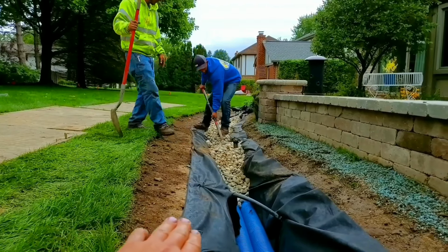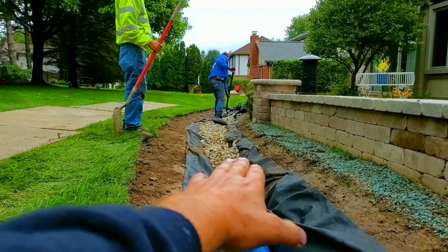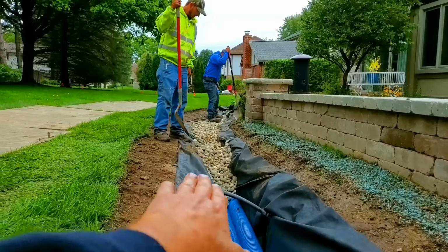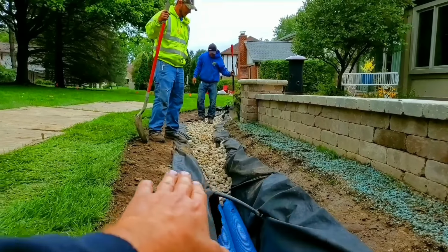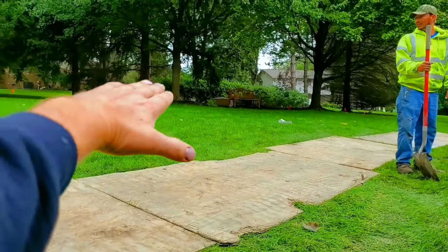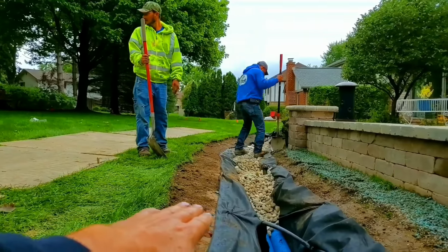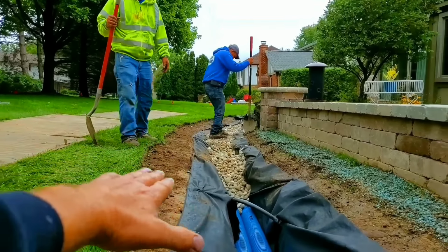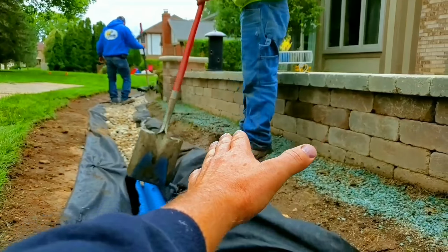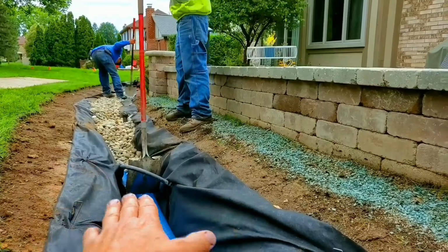You just go ahead and shave that down, and then you don't want to put your stone in like you normally will. You actually need that to kind of be concaved as well, so that when the ground is frozen and the water's coming off the high ground at a high rate of speed, you got sheet water, it'll actually sometimes pass the drain. But if you're banked up, it just does this and it gets all collected.